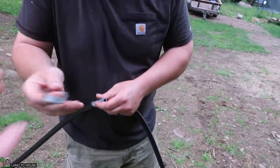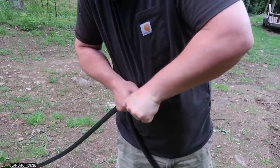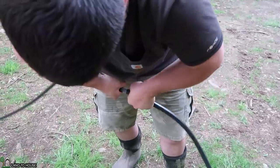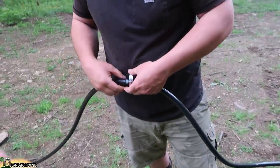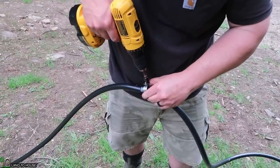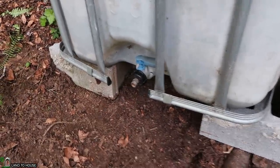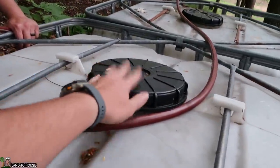I'm putting the hose clamp barb fittings on first. Since we're not lifting very high, this is going to be very low pressure, so the hose clamps are overkill — but since we've got them, we might as well use them. On top of the hill there are two 275-gallon IBC totes. They connect both of these together and run garden hose down to the pigs and chickens. For now we're just going to be using the garden hose attached or thrown into the cap.